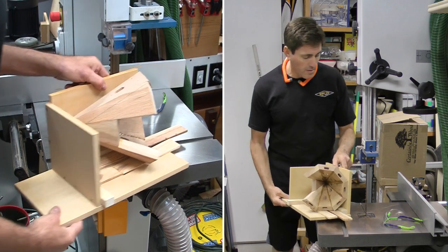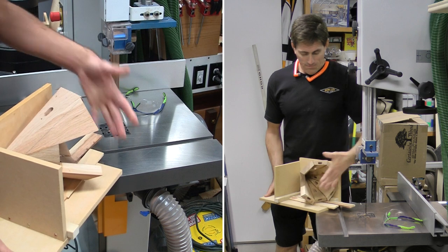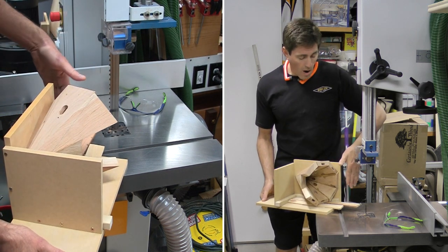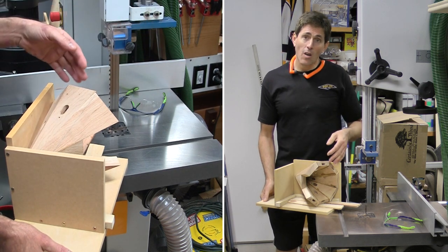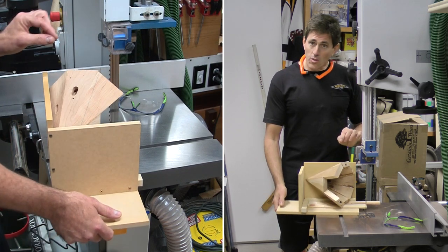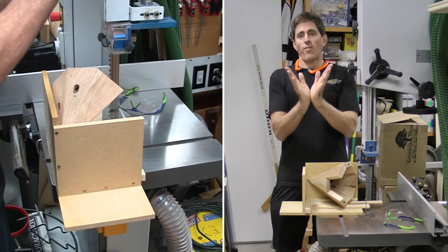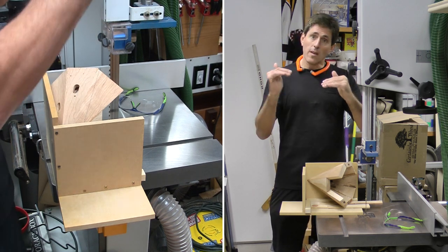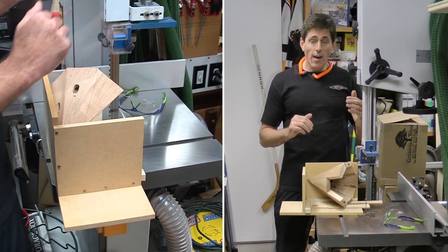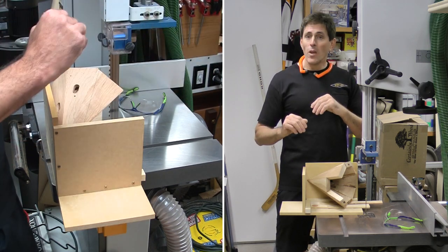Now the other cuts, I'll put this sled this way here so that you can see it more clearly. We've got this top that is all just ragged, it's just the way it came out. What I'm going to do is take the saw and cut a plane across the top so that I can level all of those. So there's a couple benefits to that. I could have cut those when I cut these facets, right? I could figure out, well, here's the inclination of the faceted sides, so what's the bevel cut to make it level on the top? So that's a lot of cuts to make on all these individual boards to make them the right height. So this is a whole lot easier, in that I can kind of hold it spatially and just push it through the blade to get the right cut.